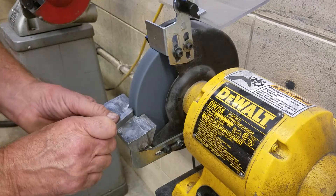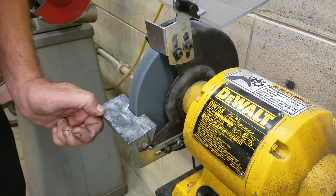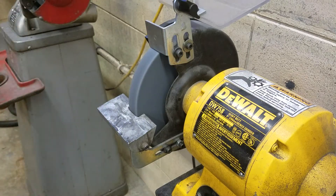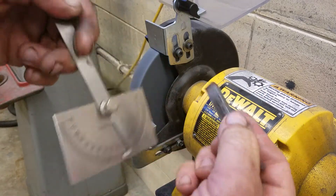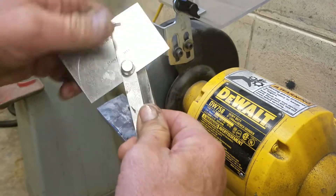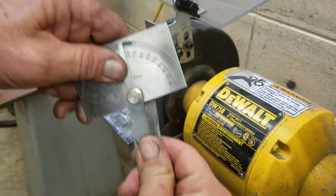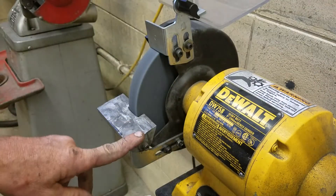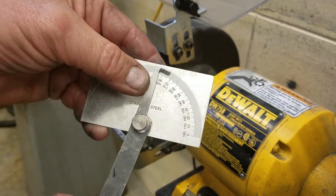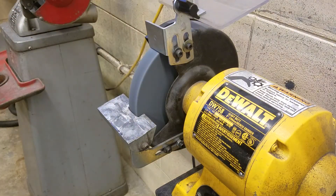One more time and then I'm going to check my angle. The way we check that angle is with a protractor, bringing it up against the front of the tool. That's going to tell me what angle I'm at. It looks like I'm about 10 and a half, maybe 11 degrees — 90 would be straight up, and I'm about at 79, so I'm about 11 degrees. I'm happy with an 11 degree angle.